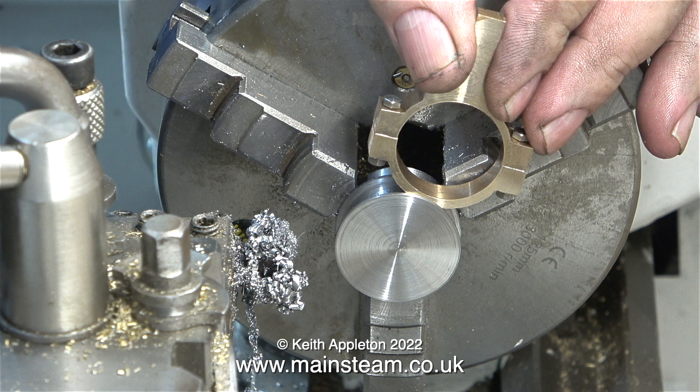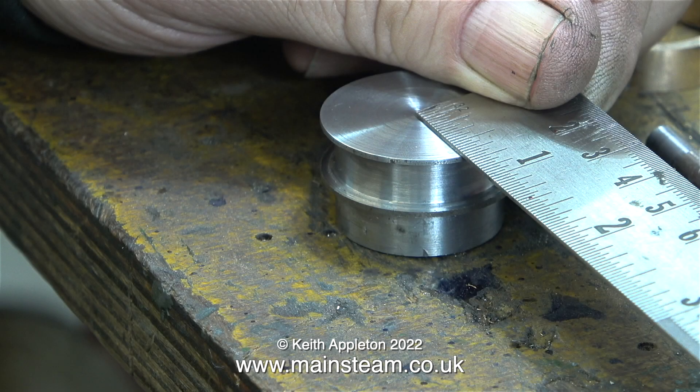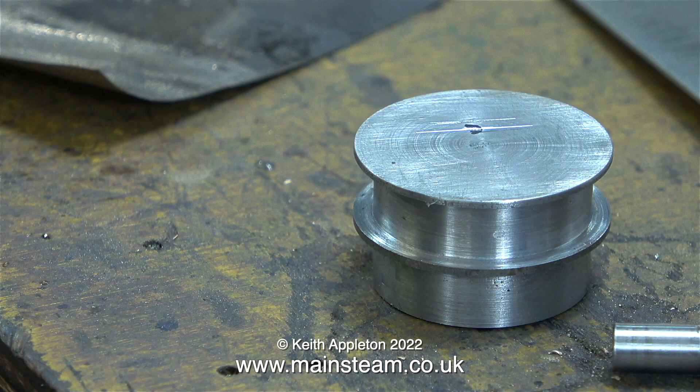What I've just done is widened the groove — it's not yet fully turned to the right diameter. The sheave is turned to accommodate the thickness of the eccentric strap. Sometimes when I make these videos I'm too busy messing around with the camera getting the angles and lighting right, and in this case I misread the drawing. Here's take two — I soon figured out that I got it wrong. The distance between the center of the eccentric sheave and the center of the hole where the crankshaft is going to be is 9/64ths of an inch.